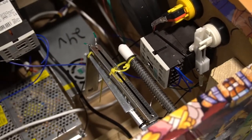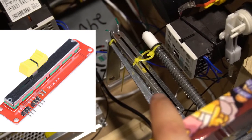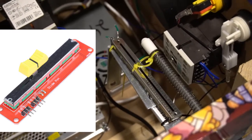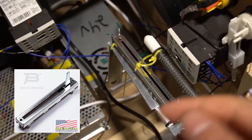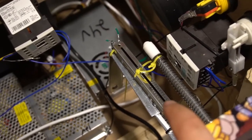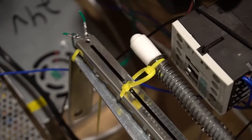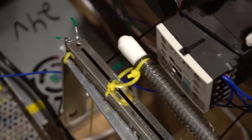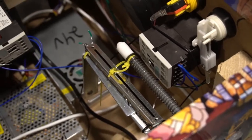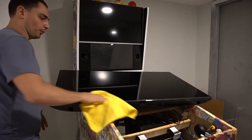As far as toys, I'm using a slide potentiometer as my plunger — and I'll be brutally honest, this thing was a big headache. Do not go cheap: the two-dollar eBay one broke after like three plunges. You need the $15 quality one. I took the smallest bit and made a hole directly into the slider so it won't go anywhere no matter how hard you pull. That potentiometer really brings the realism to playing virtual pinball.